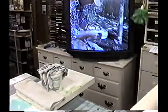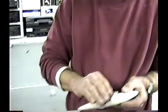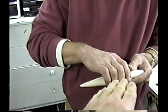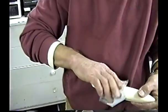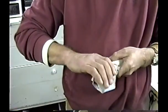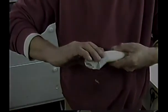Oh yeah, it's perfect. Okay. Well, let's see you do it. You're so smart. If we're so smart, how come we're still working here? Here, yours. That's the way. Just go back and forth, but don't go in this dimension anyway. You want to get all of the twisting or whatever, all the sanding in that dimension. Because in the final wheel pant, when you're all done, you don't want to have it like an octagon. It'll just look cheesy. It'll look like an octagon. Very cute.